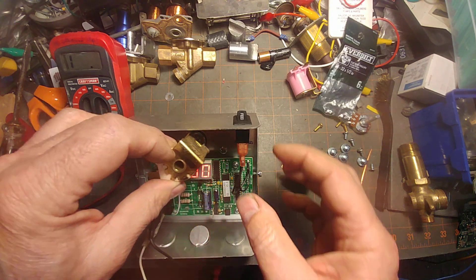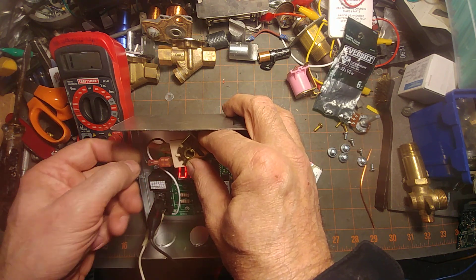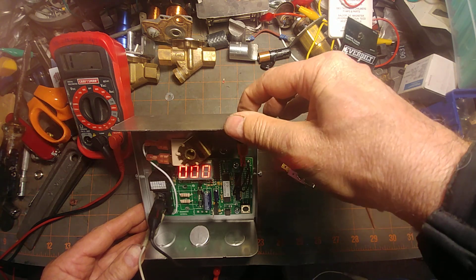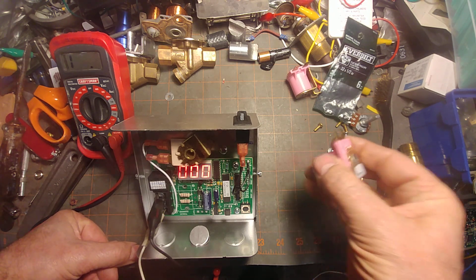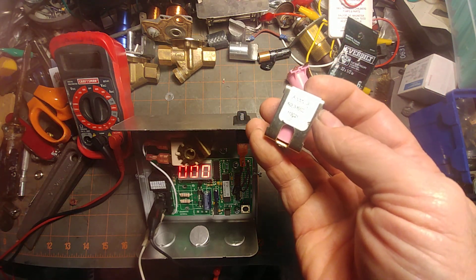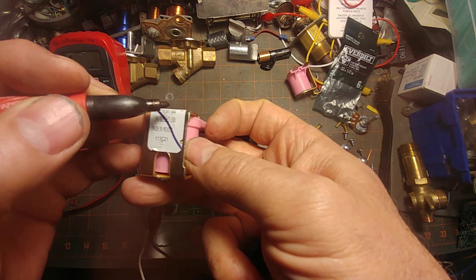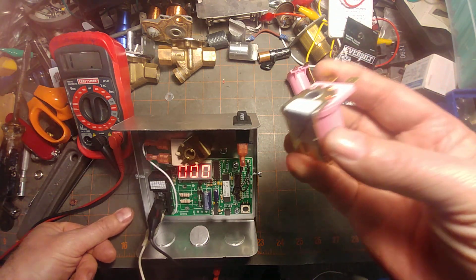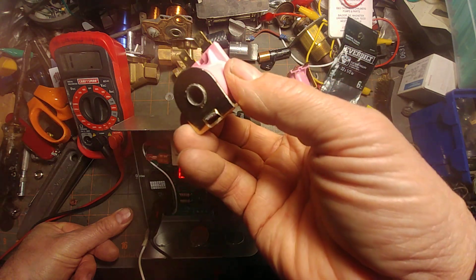Let's put this one on and see what we get. There we go — no buzzing noises, no clickety-clackities. So that's what happened: somehow this coil made it through several quality control checks at Robert Shaw's, maybe, and then through Hydro-Level's check, or perhaps it failed out in the field. I don't have an answer for why this would have failed. Suffice it to say, this is now scrap.